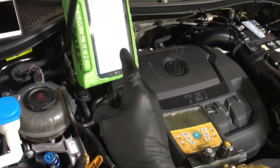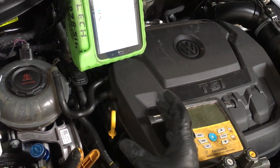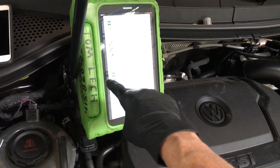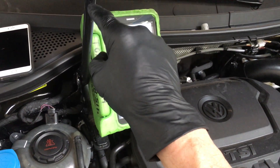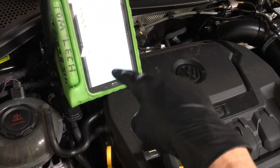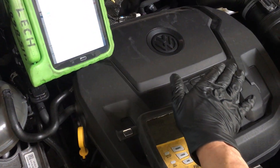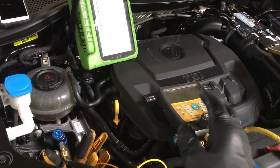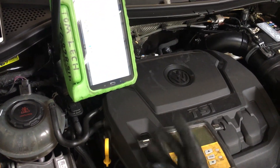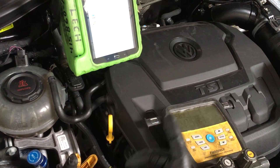I have more than one video from a month or more ago where I was showing the BlueVac Micron gauge hooked up to a big commercial system and leaving it on overnight. You can actually see it start, run all night, and watch the vacuum going down — popping up and going down, popping up and going down — and every time it goes up and down it kept getting smaller and smaller, tapering out down to a pretty steady level around 10 microns or so. If you really want to see what it looks like on a data logger overnight spreadsheet, go back and look for that video.